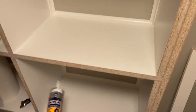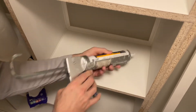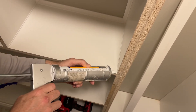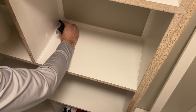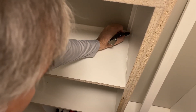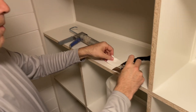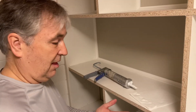So that's how long it takes to do those two. I'm going to do these two real quick — I'm going to put one bead down, then stop and put the other bead down. You can see there it got a little squirrely, so I'm going to put it back down again, take the tool, line it up, right hand on the left, make sure it's at a 90. Do a nice clean sweep — looks great. Wipe it off, come back to the other side with the left hand on the right, get it in the corner, 90 degrees again. Nice clean sweep, all done. Kind of a cool tool — much better than using your finger. The uniformity — I like the tool. It's a winner.